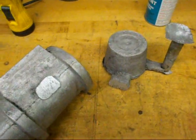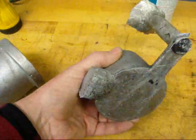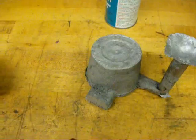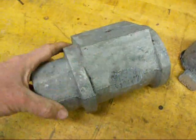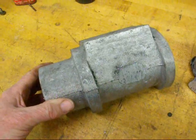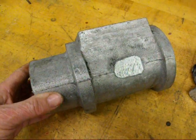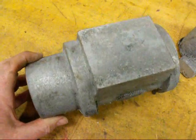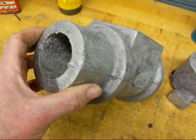I sawed off the waste stock, and this of course can be remelted — we've probably got two pounds of aluminum there or so. This is one of the biggest castings that I've made in my home foundry and I had to make a new crucible in order to melt that much metal. I was still kind of guessing and I used just about everything that was in that big crucible, so I'm glad I made it as big as I did.